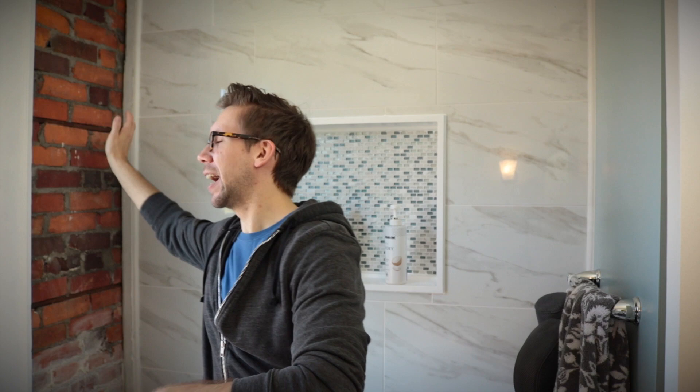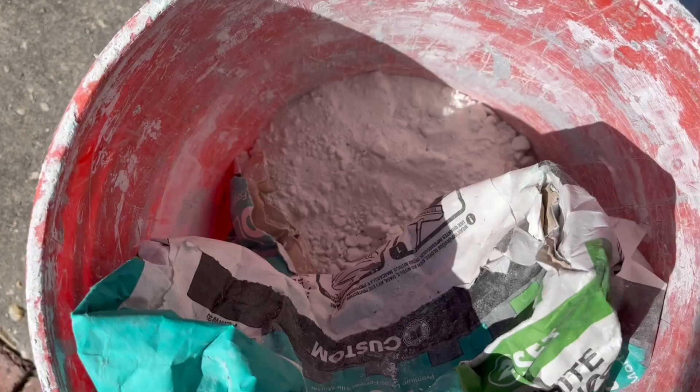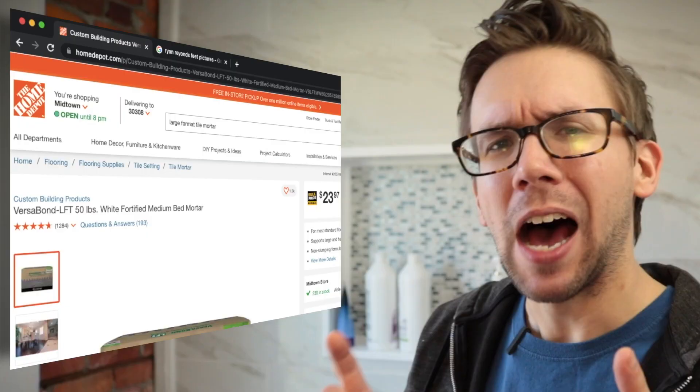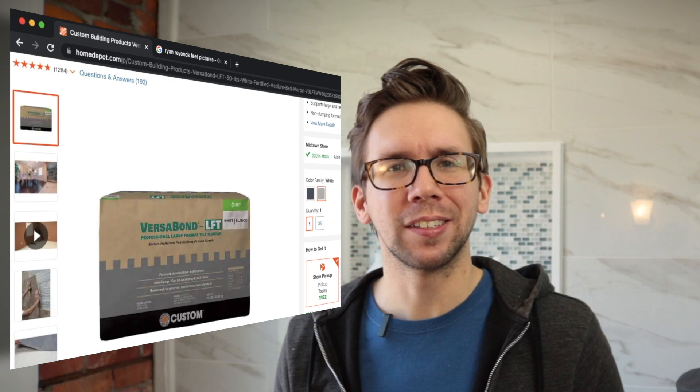If we just lime wash this wall, it's like rubbing your hand over gravel glued to sandpaper — it is just not fun. So to give this brick a good old-fashioned whitewashing, we're going to use tile mortar. Any old tile mortar will really do, as long as it's white in color. I'm most fond of this large format white tile mortar — it's what's left over after doing this wall, so that's what's going to get used.